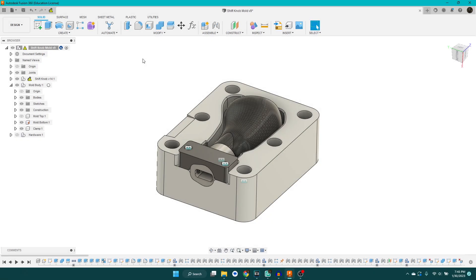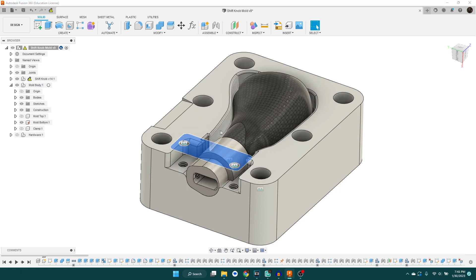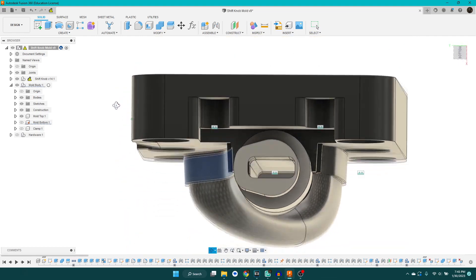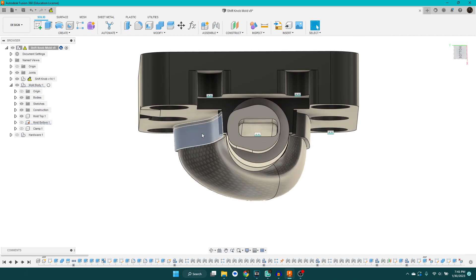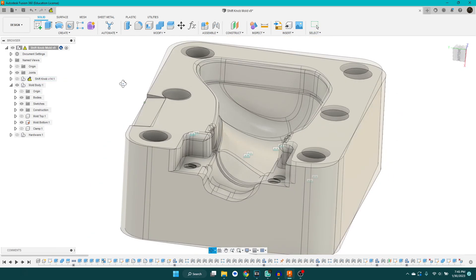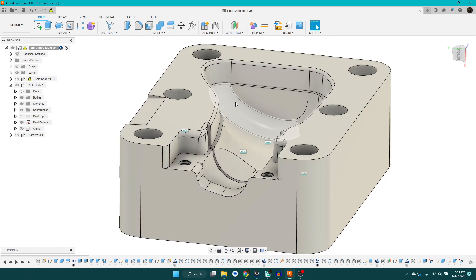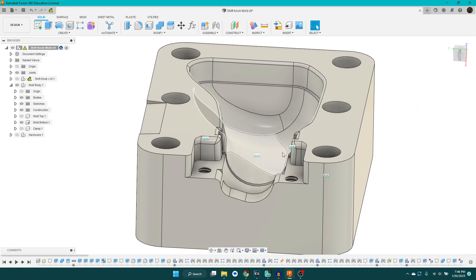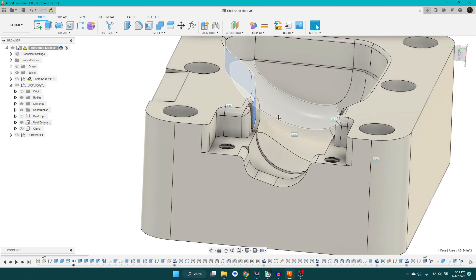Let's briefly talk about mold design. I'm not an expert, but there are a few key things to incorporate into your mold that you can tweak and improve as needed. The first important one is the extended wall — you can see that on both the top and the bottom — and that's going to give us a little bit of extra room to compress the material and allow it to overflow just a little bit on the bottom, then be compressed into that mold half. The second thing to pay attention to are draft angles — these are angled walls that allow you to remove the part more easily. My part didn't really need any because it's cylindrical, but these walls are already angled and you want to shoot for 2 to 3 degrees on this kind of mold.